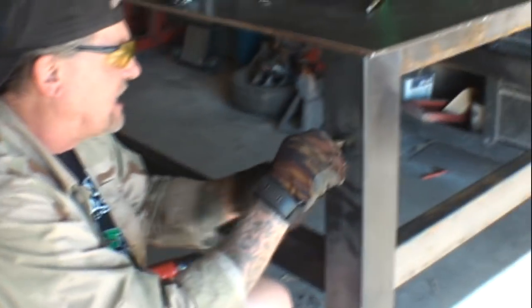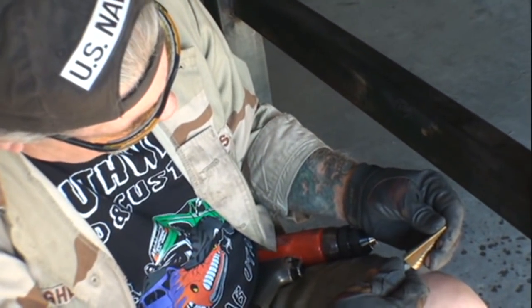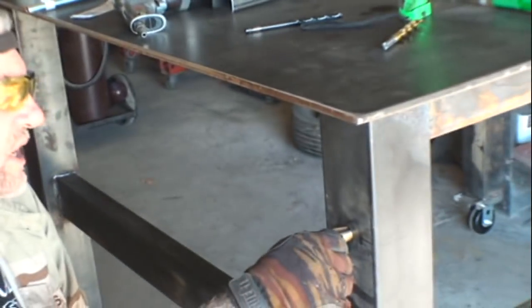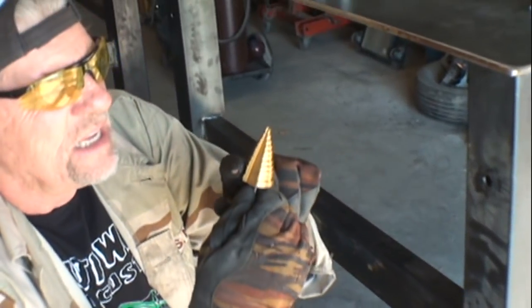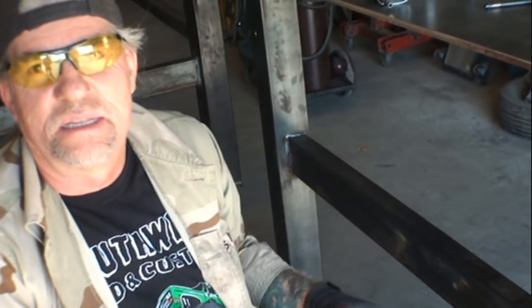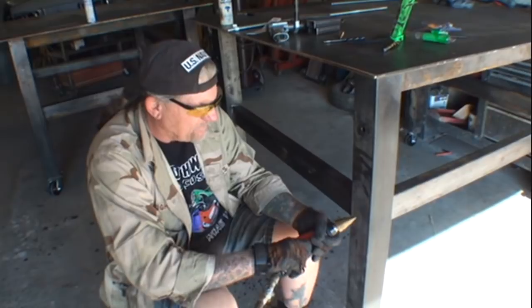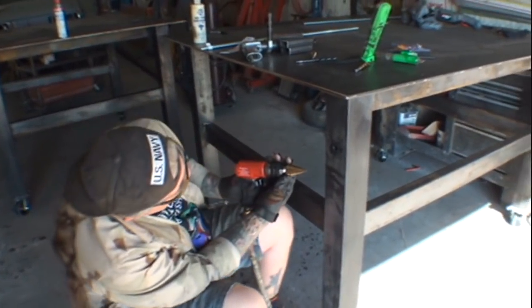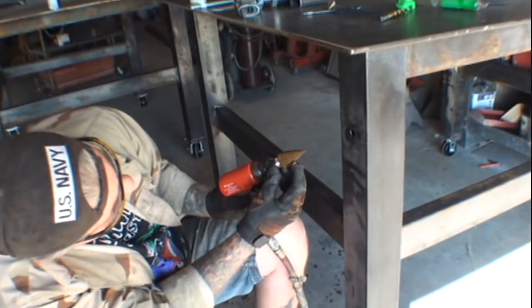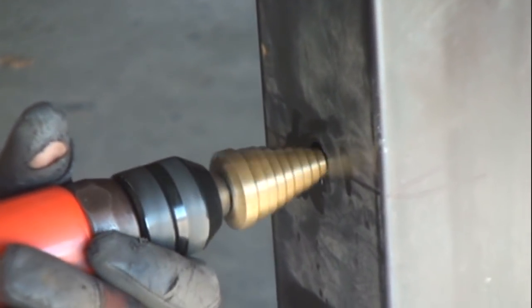That's why we are gonna make this hole bigger. I'm gonna look at this one and stick it in there — that's kind of small. So we'll use this smaller one on this side and the big one on that side, and we'll see what happens. This one here goes up to 7/8. I think if we go to a 7/8 hole that's not gonna be big enough, so we're gonna go a little bigger. Usually when you get this kind of stuff, the bigger they are, the harder they are to work. I do have a set of little ones I haven't opened yet. We're using a 3/8 drill — it doesn't have a lot of torque, and we're gonna find out if this thing cuts its way to success.